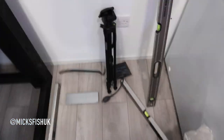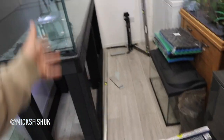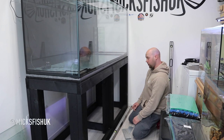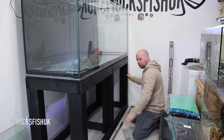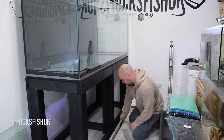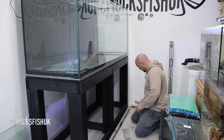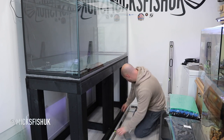So what you can do now, get yourself some shims in the corner. I'm going to pop this camera up somewhere — it's quite hard to film in here because as you can see there's tanks everywhere, it's a massive mess because I'm sorting it out. So, I'm struggling a bit but let's set up the camera. The first thing you do is level your floor. I know this tank stand is perfectly level because I built it — everything was 900, 900, 900, so it's all nice and square. I've just put a six foot level on the floor and it's running out like 20mm. Get yourself some shims and put them underneath there.